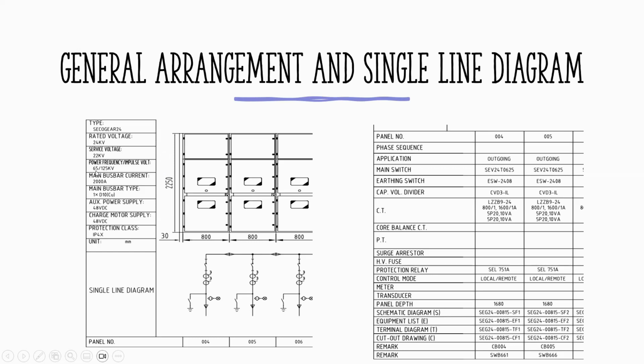At 1 minute, the board should survive. That's some kind of torture test for the switchboard. But in the factory, before they deliver this on site, they have to do a lightning test, or they call this the impulse test, at half wave. One cycle is 20 milliseconds, and this impulse test is half wave, or 10 milliseconds, but it's way too high compared to the normal testing that we do here on site.